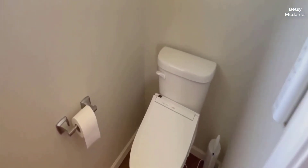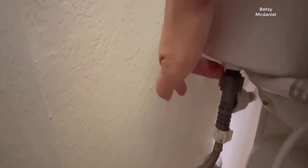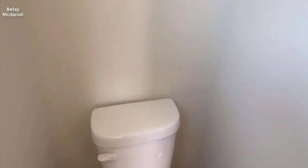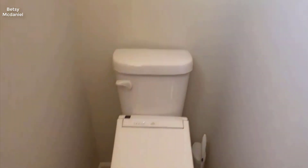First off, this thing is easy to install. There's a little T-connector that goes in here — you can see it's a little plastic piece right here. This one is connected up to here, you disconnect that, you add this piece, and that allows this toilet seat — I've got it turned around here — the T supplies water to the seat.